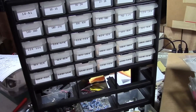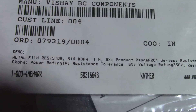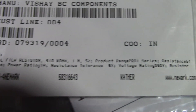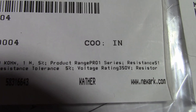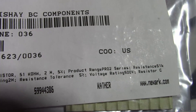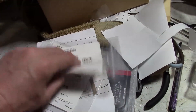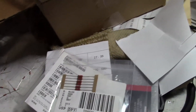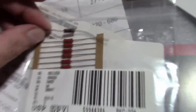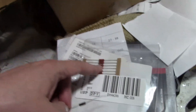So that's about it - perhaps not the most exciting of components but worth giving a little thought to. Here's a closer look at the specs on those Vishay resistors. Here is the PR01 one watt variety, rated for 350 volts. And here are specs for the PR02, two watt, rated for 500 volts. If you're starting out I highly recommend you get the PR02s - you can always use a higher wattage resistor in place of a lower wattage one, and these are pretty much identical in size to the very common half watt carbon comp resistor, so you can use these to replace half watt, one watt, and two watt resistors.